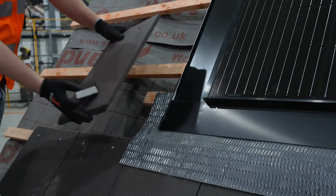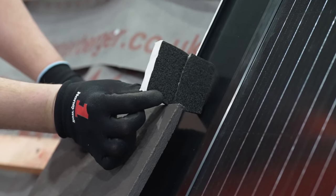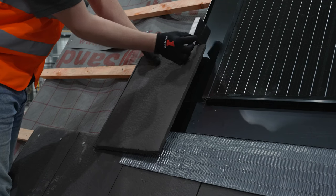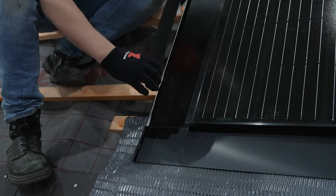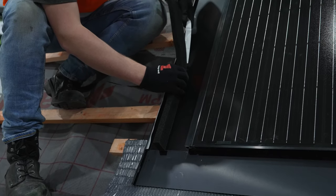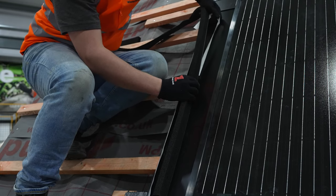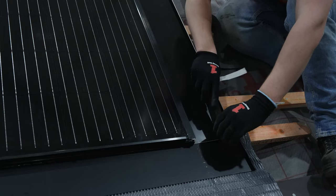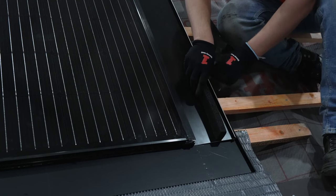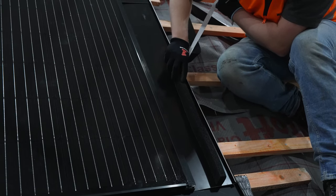Next we will install the foam, otherwise known as seal strip 02. Offer a tile into position maintaining the correct bond to identify the best positioning for the foam — approximately in the center between the edge of the tile and the flashing. Install the foam up the length of the flashing, removing the backing as you work your way up and finishing at the very top of the system. Repeat the process on the opposite side. The foam is universal and designed for all Sandtoft roof tiles — it will need to be trimmed for certain tiles, and on some taller pan tiles may need to be doubled up. Your kit will have sufficient foam for all scenarios. For profile tiles, install a length of foam across the length of the top flashing.